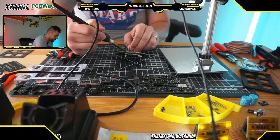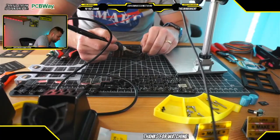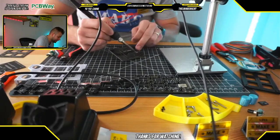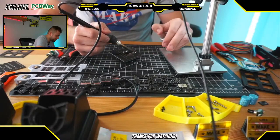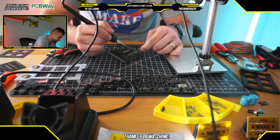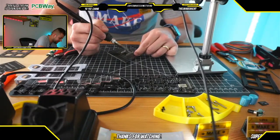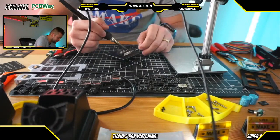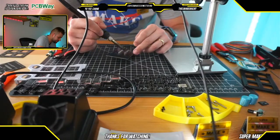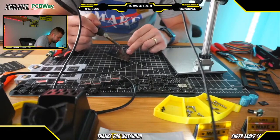So I went online and found an LCD monitor that was perfect for the application, but there was a little problem with the LCD monitor that I found, and that is that it was primarily designed for the Arduino Uno, which has a lot of pins. And the Arduino Nano is basically an Arduino Uno but smaller. But the issue was that it had just a few too many pins in order to interface with either the Atmega32U4 Arduino Pro Micro, which emulates a USB keyboard, or the Nano directly. So I thought, okay, I definitely don't want to use a different microcontroller just because, for hobbyists that are just starting out with this project, those software ecosystems aren't as well developed.